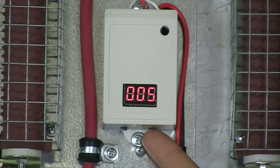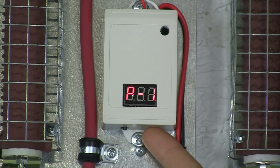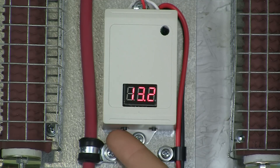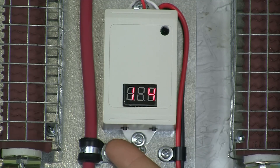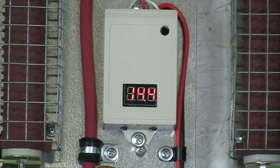You must enter directly from P1 to P3. Hold the Enter button until you see P1, then press Set to get to P3, then press Enter. This is your voltages screen, so we'll start with 12 volts. Press Set — the first screen should show 14.4. Use Set to scroll and Enter to change any digit.